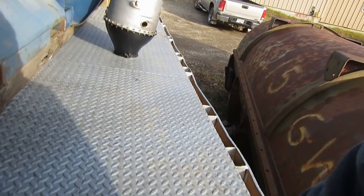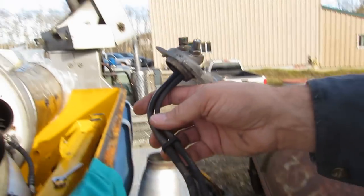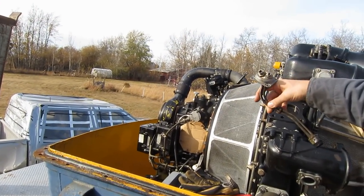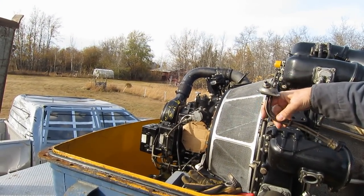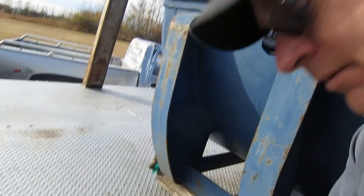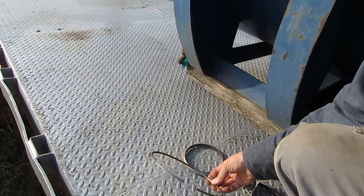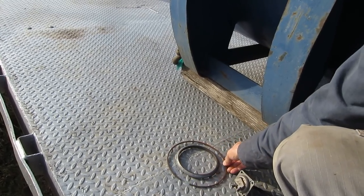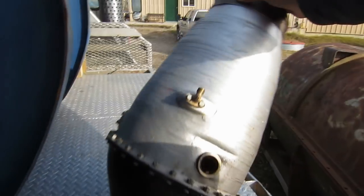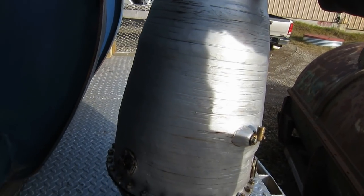Right here, we've got an assortment of parts. This is the duplex burner — it's all dirty and sooty. The smaller line is for starting and the bigger line is for running. We've got sealing rings from the front or compressor side and the rear or turbine side of the combustor outer casing, which is right here. The black part is the inlet from the compressor, wrapped with a kind of an insulating material.